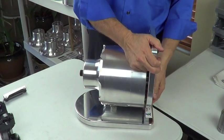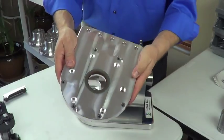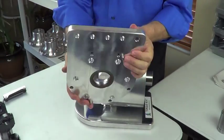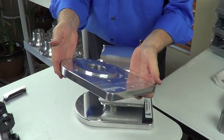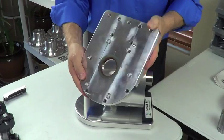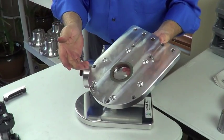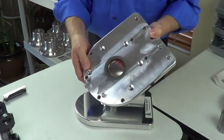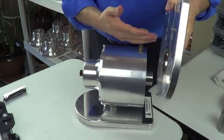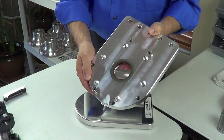Now we can wiggle the adapter off of the front. This is the adapter plate. There are numerous different adapter plates depending on what we're fitting — some are square, some are rectangular. This one is for a Turbo 400. It's 6061 T6 material. It has two alignment pins. All of our housings have pins; they're all in line and just keep everything centered and straight.